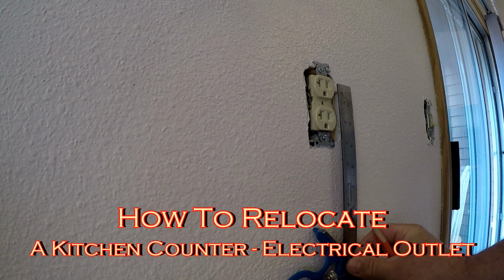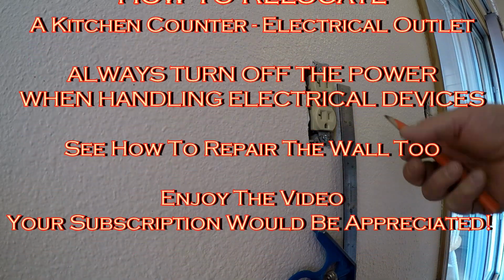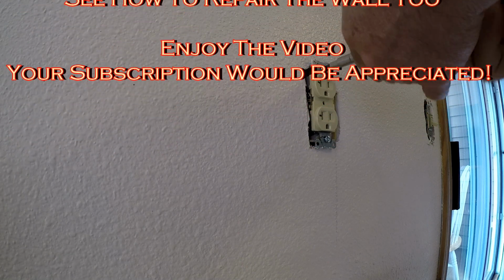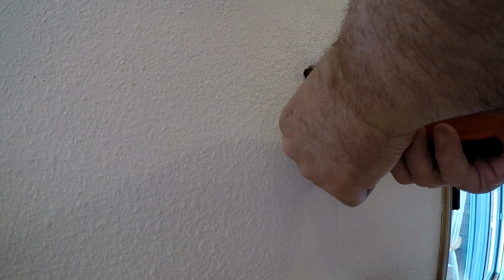In this video, I'm going to show you how to relocate a kitchen counter outlet. The line I drew there is where the end of a new tile backsplash will be, and the outlet is right on the edge of it. That's not going to work. We're going to reposition the outlet 9 inches over to center it on the wall space.